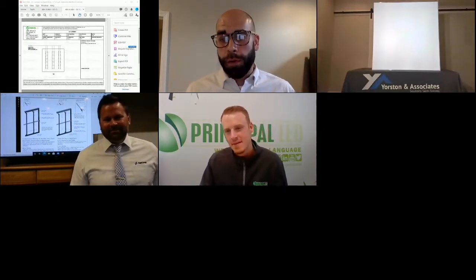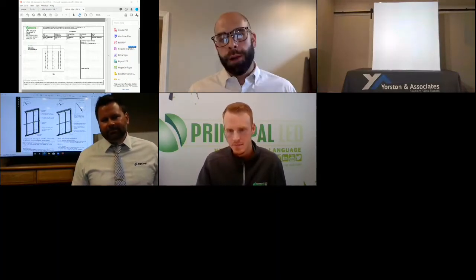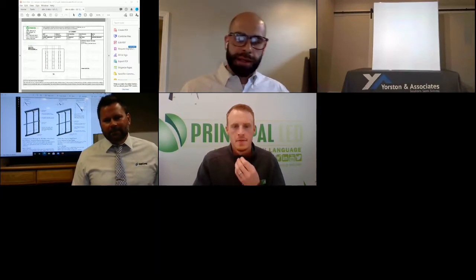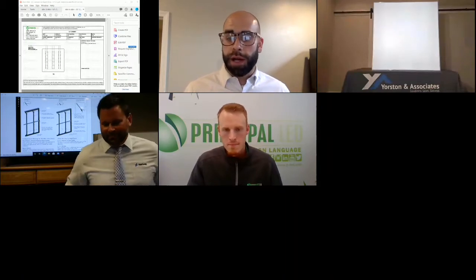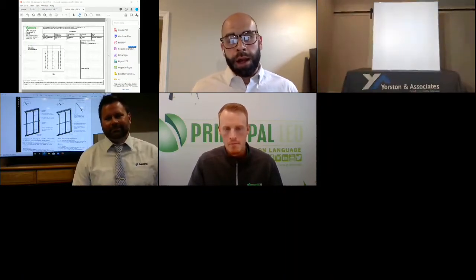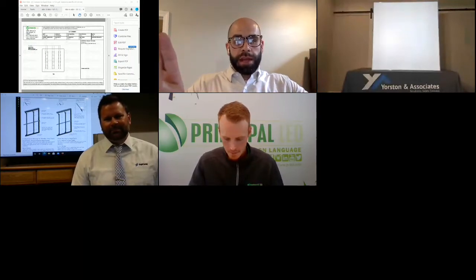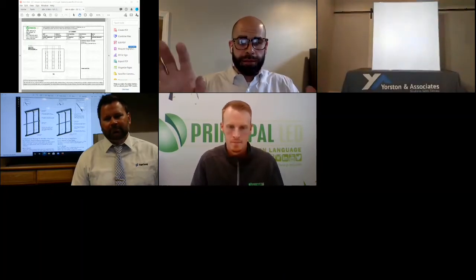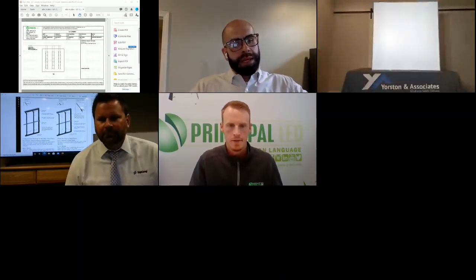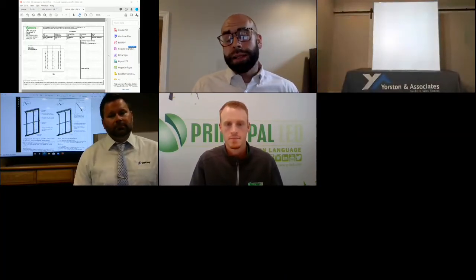So Brad, depending on the size of the pole, sometimes it can be a huge issue if you've got a really, really big sign. But for the average sign, where we're seeing a pole anywhere from 4 inches to 8 inches, those are probably the most common pole sizes I'm hearing about. Depending on the depth of that cabinet, oftentimes it's about moving the LED far enough away from that pole. So again, where we were talking about those beam angles, if Lauren can throw that up again, that beam can shoot around that.